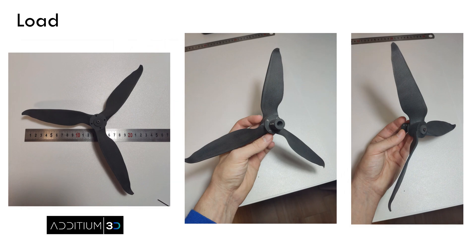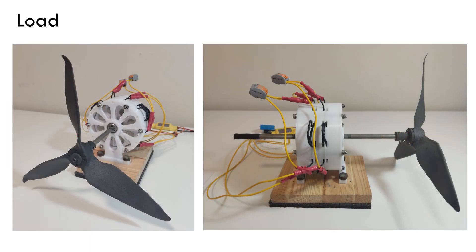After the incident, I ordered a new propeller from a local 3D printing company. In this case, the propeller was 28% larger than the previous one and was made of nylon, which significantly improved its mechanical properties. For safety reasons, although I was aware that the rotor could withstand more than 8000 RPM from previous experience in other motor projects, I decided to set the operational point at maximum voltage at around 5000 RPM. This is why I made the propeller a little bigger trying to increase the load torque.